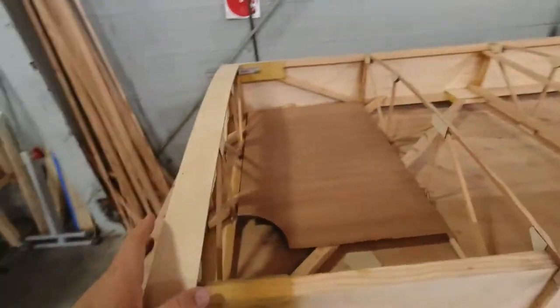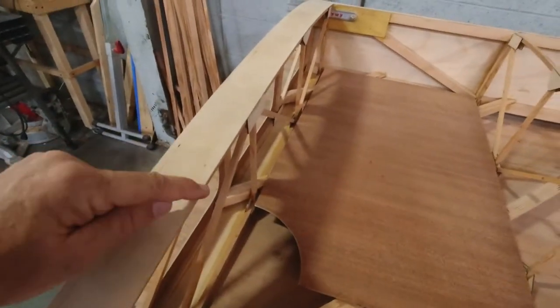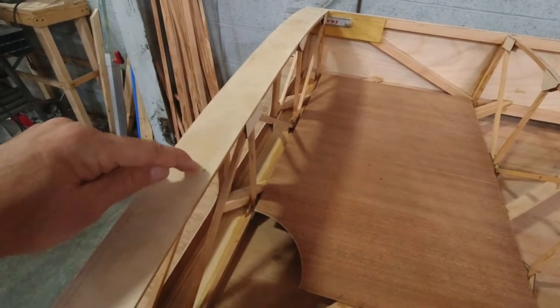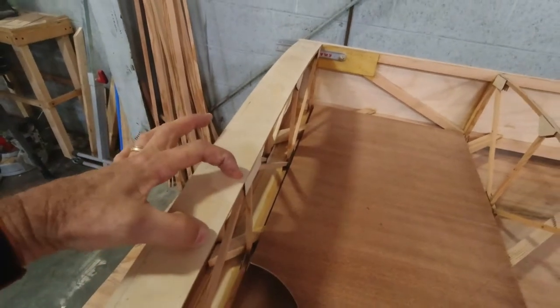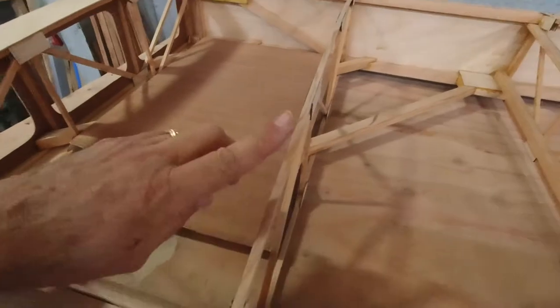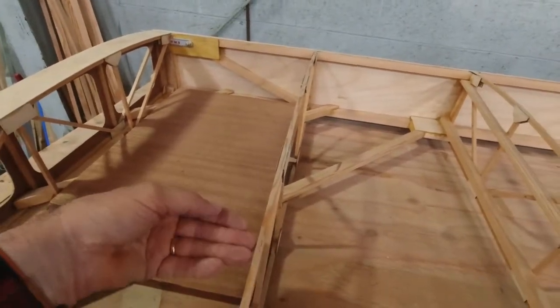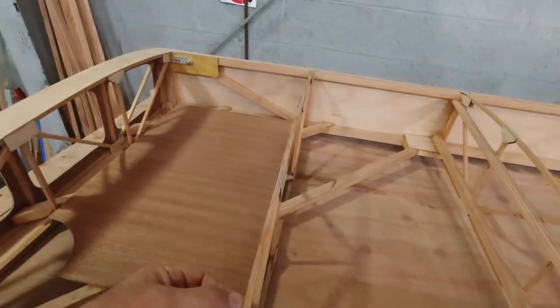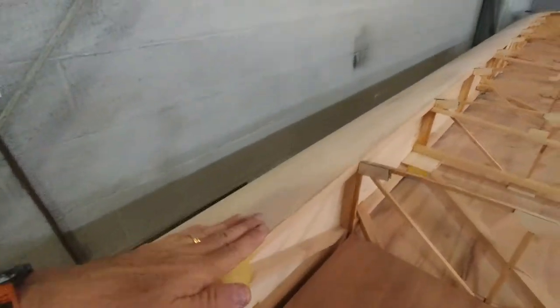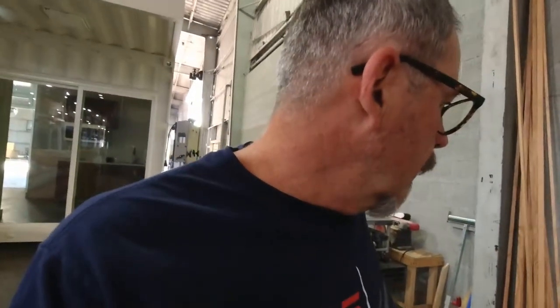But now you can see that I've got this turned over. What's going to happen is in the tank area, which I'm feeling for this piece under here, it goes back to about right here. There'll be a cross member here, and this is where this piece of plywood is going to get routed out for 3/4 of an inch and then go all the way forward, so it'll leave a reveal here, and then there'll be a piece of plywood with a 3/4 inch reveal here. I'm going to put a piece of plywood cap strip on this rib, and that will then allow me to attach the RS-17 to the side here, and then I'll have a 3/4 inch reveal in this location. And we'll have the same in the front, because this piece is actually a 3/4 inch piece. That'll put us in a really good spot. And then there's a piece that goes to support this rib. We'll get that in, and we'll see how far we can get here.